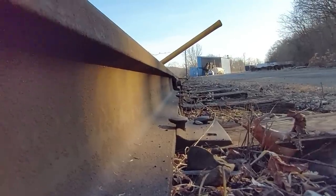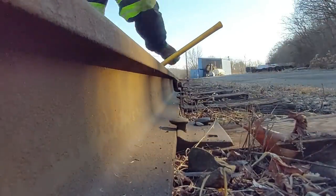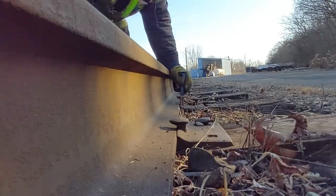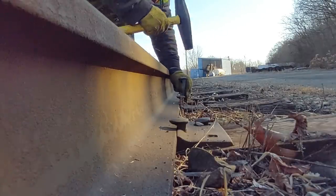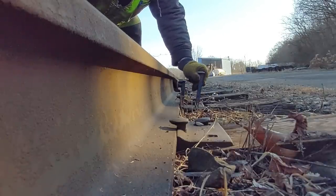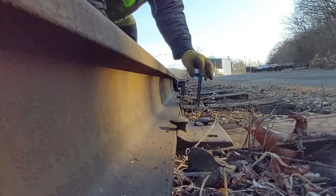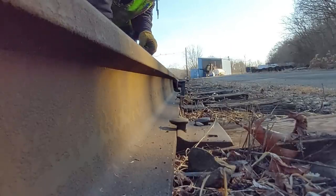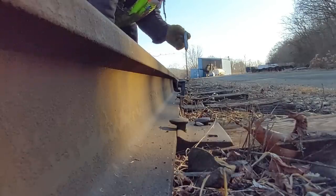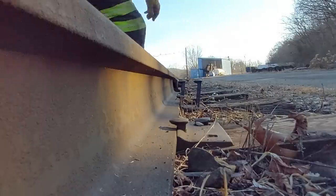I wanted to tell you something — I told you you set the spike straight up and down. Another thing: when you set a spike, you drive it in so it's solid. You don't want that spike wobbling around up high, because when you go to hit it and it's loose in there, you can get off to the side and that spike is going to go flying. If you've got somebody in there working they're going to get hurt. So you want to set them a little bit solid.